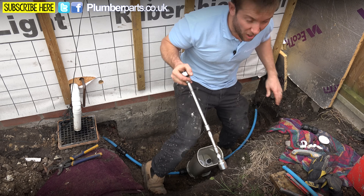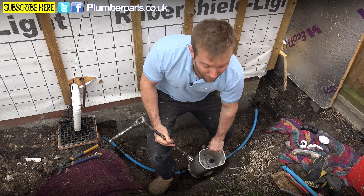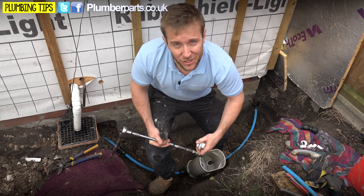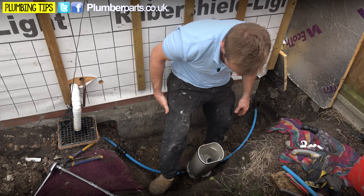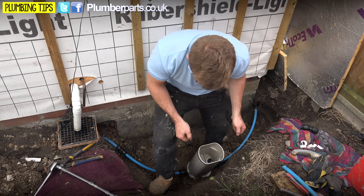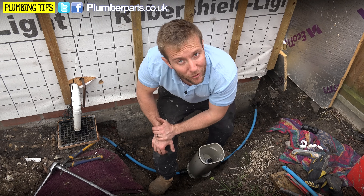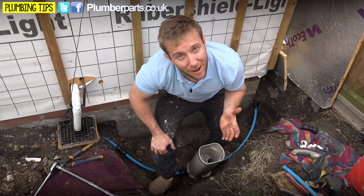Regardless of whether this video is about MDPE pipe — if you are fitting an Atlas chamber, they usually come as new ones without the bung. So you're going to want to go online and grab yourself a bung as well. You pop that in and then you can use it for a couple of days until the water board come along and actually wind your meter in. Now it should just be able to go back out to the road, turn this water back on, then we can test all this for leaks, and once we're happy there are no leaks we can backfill it, pop our telescopic extender on, and wait for the patio guys. You'll have a standard Atlas chamber in there that'll look really great, be really easy to get to, really easy to read the meter, and easy for the householder to turn the water off.